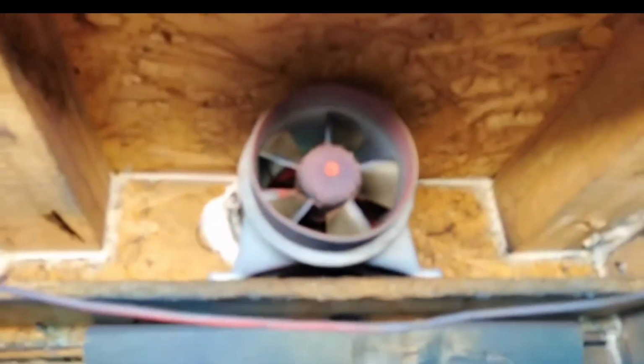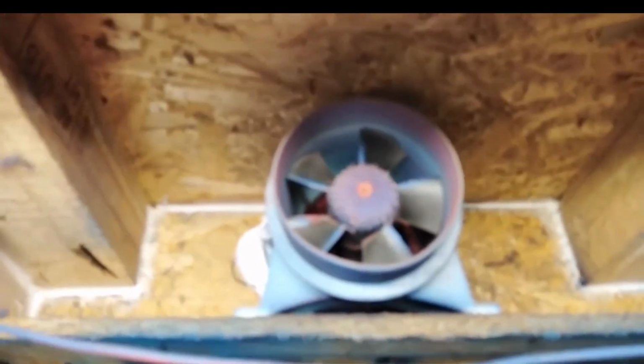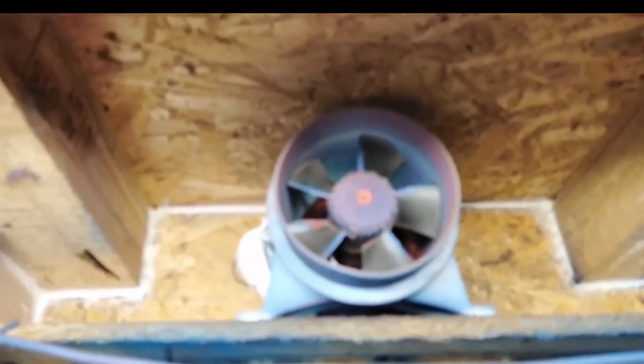Now, a week later, I found that 240 volt fan just weren't man enough. The spray booth has had a modification. I found the electric fan, the 240 volt bathroom fan, was rubbish. This cost about £16 online from eBay.